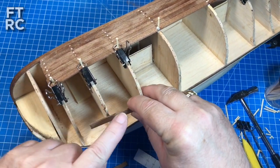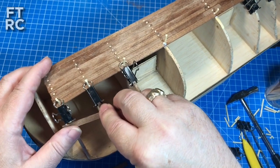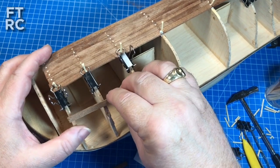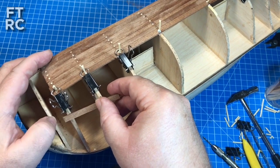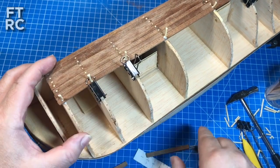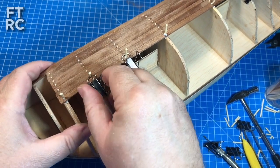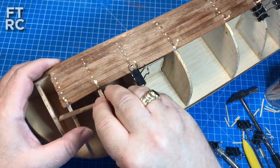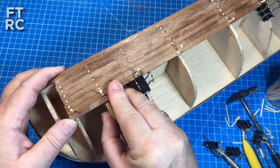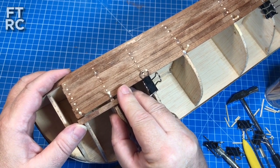Normally you taper the top of the planks, right? When you're doing your tapering, you taper the top because the planks tend to, when you put them on, bend up on the curve, right? So they sit nicely. You take a little bit off the top, as much as you need, and that lets it sit up against. Probably easy if I pull these off. I have shown all this in the marina balcony, the one that says walk the plank. I went into all this theory, but it's easy to see. So if this actually was tapering, see how it would actually go up. It goes up and over there. So if I bring it down, it goes up and over.